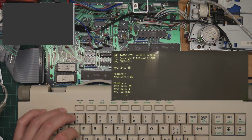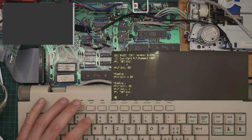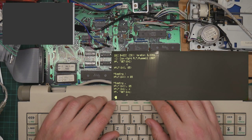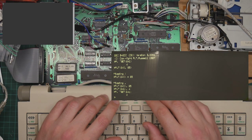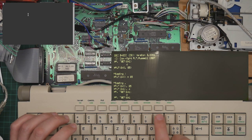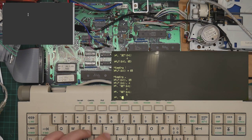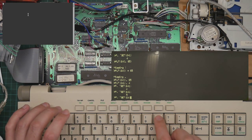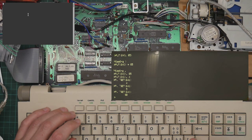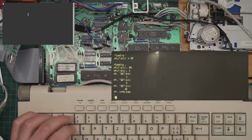I wonder what has happened. We can't capture, from manual testing like this, all the states. One thing I can try is putting the cursor in the serial terminal and typing something, just one key, and let's see if it's transitioned to the readable state. It has. So now we should be able to read the byte, which was a 6B. So if I print that, that is indeed the character I typed.